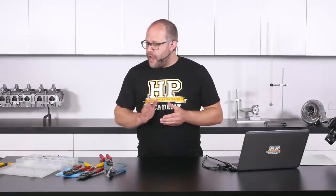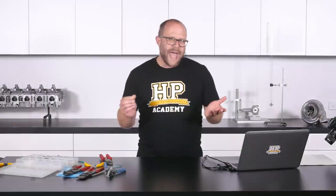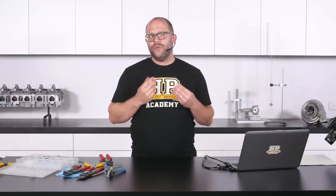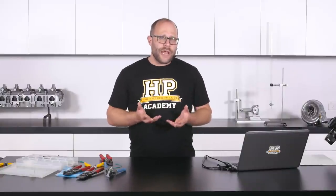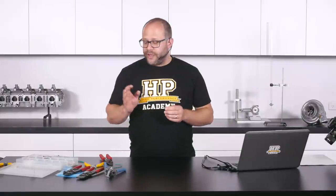When we get into sizing our splice, we'll talk about something called CMA — Circular Mil Area. This is a little bit of an unusual but common measurement you find when dealing with wire sizes. It's a very American measurement based on inches, not metric at all, and it's a way of sizing a circular area as if it were a square. The way you calculate the circular mil area of your wire is to look at the diameter of that wire and simply square it — basically a way of avoiding having to include pi in the equation. Because all these calculations reference back to one another and the splices are sized for that measurement, it does actually end up working quite well.